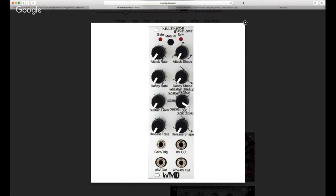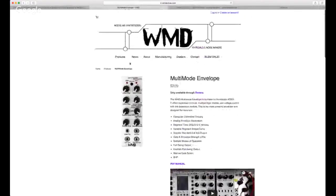Yeah, exactly that. And for me, when it's like a looping AR or AD, just standard two-stage triangle ramp style LFOs, just having the bipolar version works really well, rather than having to think about re-offsetting that. There is an expander for this one, if I can find it.